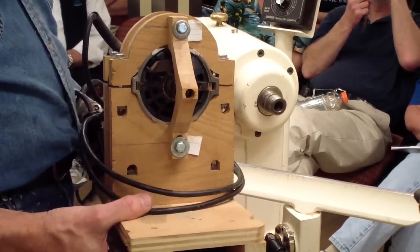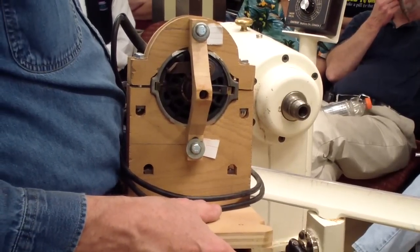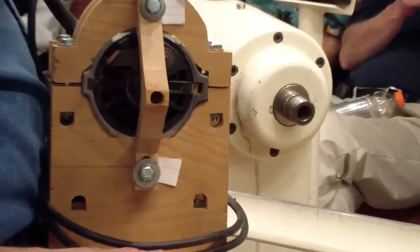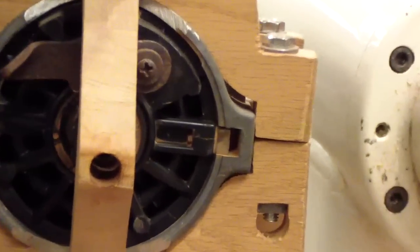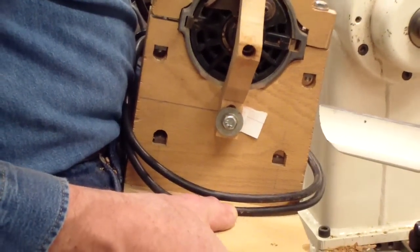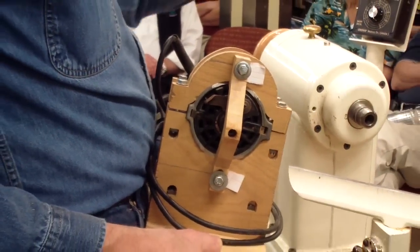And with this here, the only requirement is that you hold your cutter at 90 degrees to the tangent of your stock. So if you have a large curve, you have to twist your router around so that you're always pointing straight at the surface. Because if you don't, your cutter's out here, you move over here. And that's it.